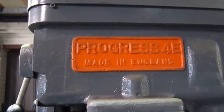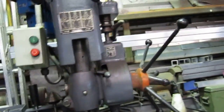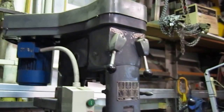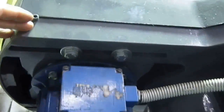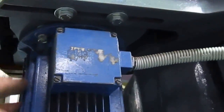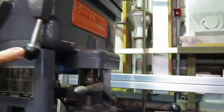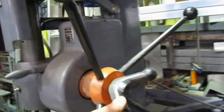This is a Progress 4E, made in England from days gone by. It's one that I received from an old gentleman who could no longer work and had no drive system on it. Fred went to the trouble to build a drive system for it because it had a gearbox section up the top. He made this plate work — laser cut and welded — and fitted and mounted a flanged motor that I had, and we've wired it up and set it up. It's a majestic piece of machinery. It's a geared head machine plus V-belt drive, and within itself it has these three feed speeds. And this lovely old nut here — you turn it in and that locks the system into working.